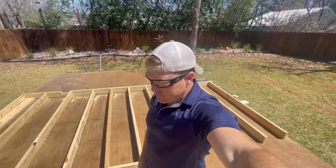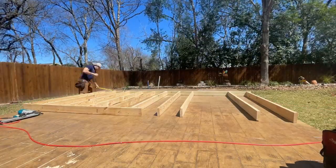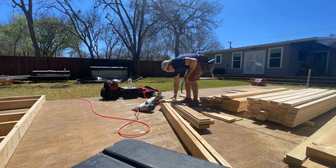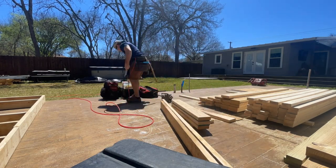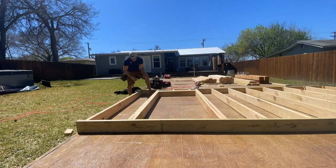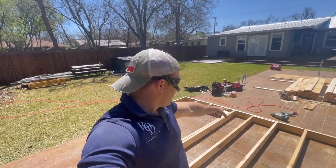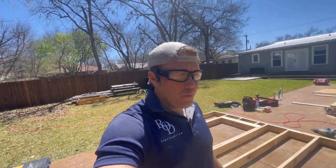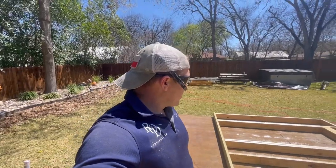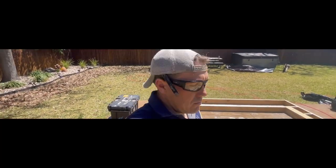Going to lift it up and brace it. Wall's done — majority of it anyway. All the studs, everything nailed in. Improvising on the top plate there — didn't like doing that, but I had a 16-foot treated 2x6 I didn't want to use since I still have more walls to frame with it. Door header in, cripples, jack studs, king studs — all done, everything nailed and screwed together.